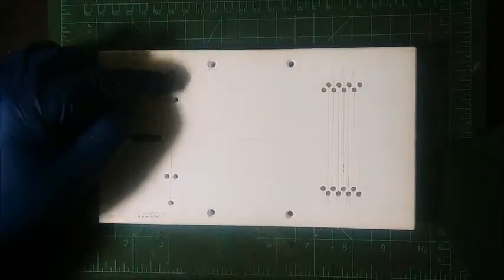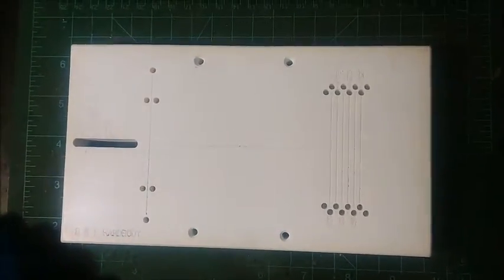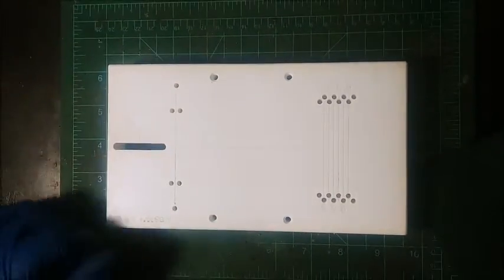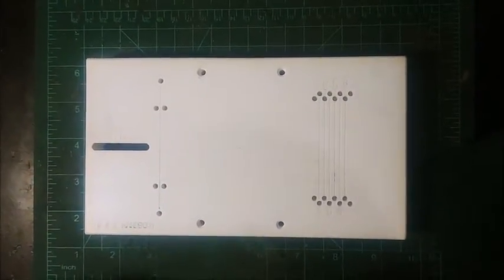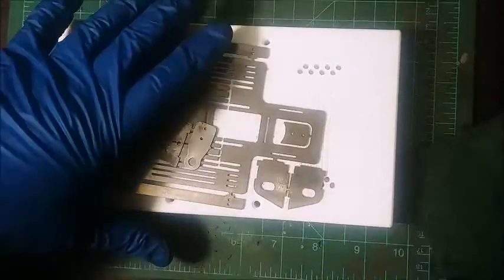And you also have some pins where you can set your front tire width when you're actually using solder-on collars or like a Bardos threaded axle. You can figure out how to even it up. It's basically tapped, so you can hold the chassis down with our special holders. That also works as a good body pinning fixture. So we're going to go ahead and move this stuff off to the side, and I'm going to grab the chassis that I already kind of cut and prepped and set on the jig block.